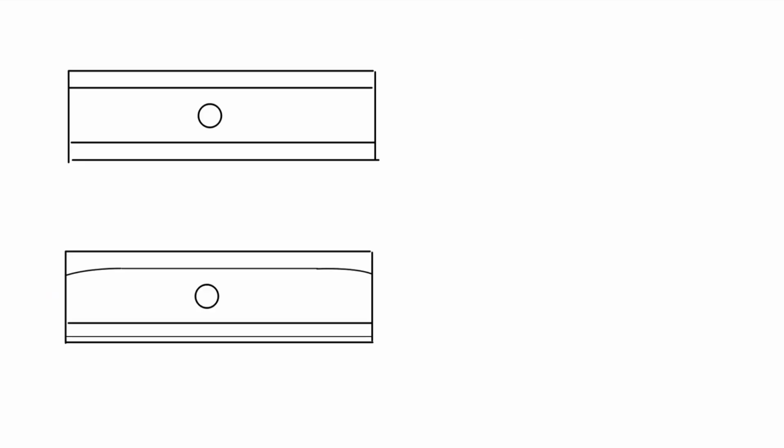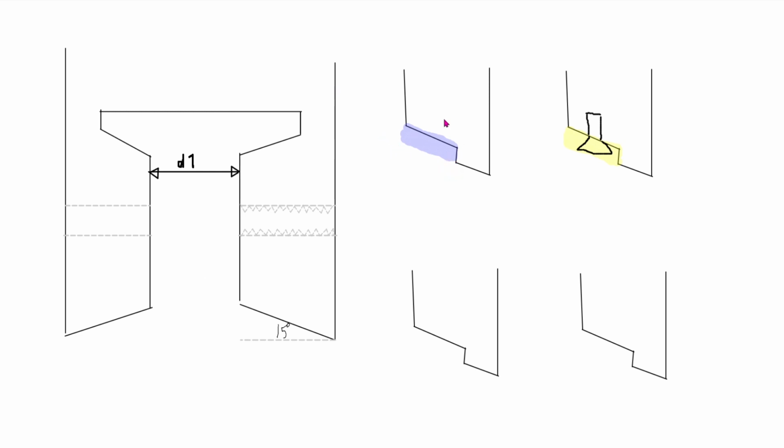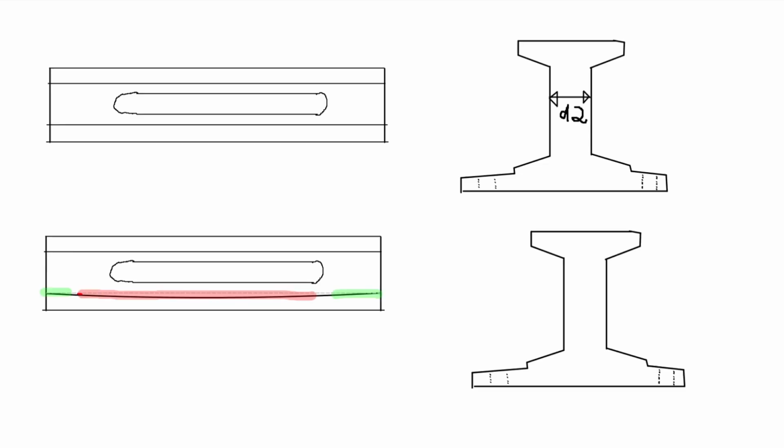So that means that if you only do this fix, which is doable by hand, you weld this up and then you file this down and use this surface as reference, or you machine this down and use this surface as reference, this part here, this not worn down part, then it will still be sloppy. Because while it would be tight here and there, it won't have enough contact area to not be sloppy in the middle, and if you tighten it up with the bolt to compensate for that, it will get stuck at the back. So it doesn't make any sense, it doesn't really do much. So you really need to fix the static jaw first.